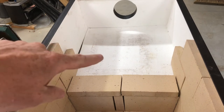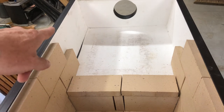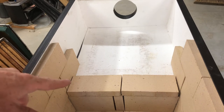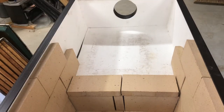For the back part it made more sense in my mind to do the sides first, because the distance from inside of the paper to inside of the paper was 21 inches and the fire bricks are nine inches long — which is not a multiple or factor of 21. With the fire bricks being the width they are, it lets me lay two bricks without cutting. I'll decide whether to alternate seams or not. This is literally just a fire zone — no wood ever gets up here, just flames coming up and going out. Next step is to complete the sidewalls of the back half.